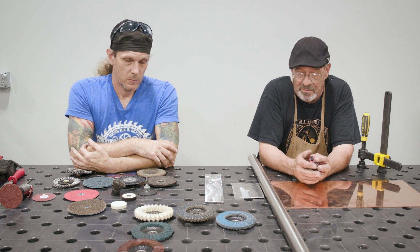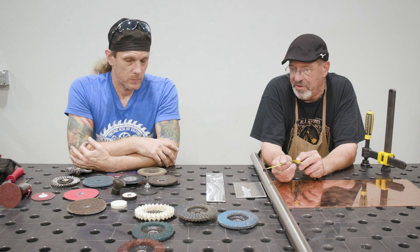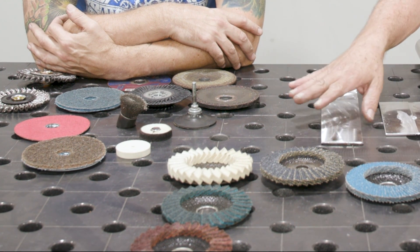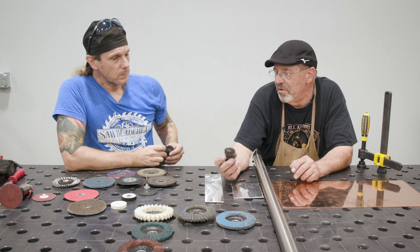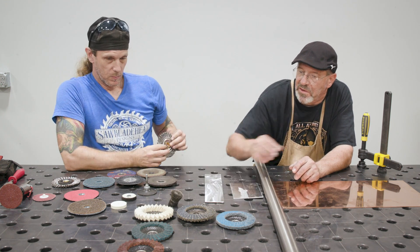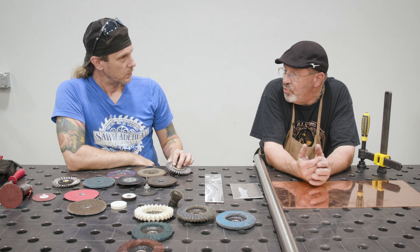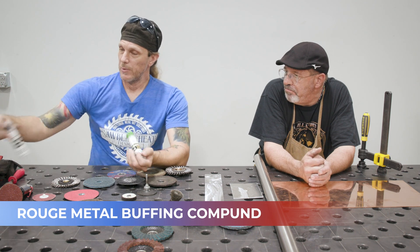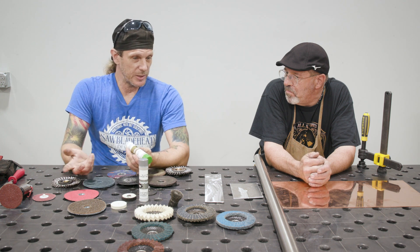The importance of all this — there's just a plethora of abrasives you can grab. Some of them are aggressive, some are geared toward blending and polishing, some are just the plain old wire wheel on a die grinder or a drill, and some are aggressive wire wheels. I'm not here to name brands. There are some fantastic products out there. We've got a little bit of rouge — we've got the green and the gray, which pretty much does the whole gamut of all the metals from copper to stainless.